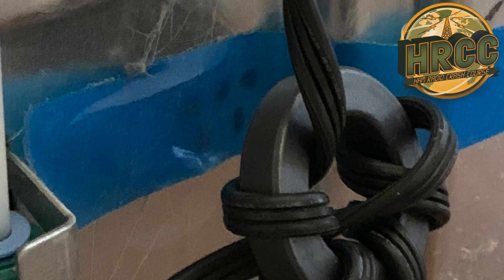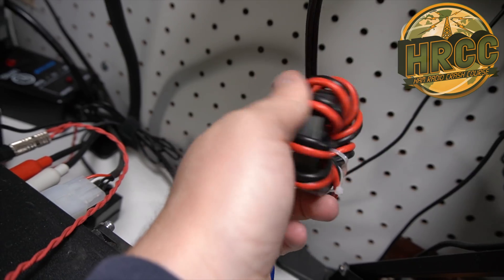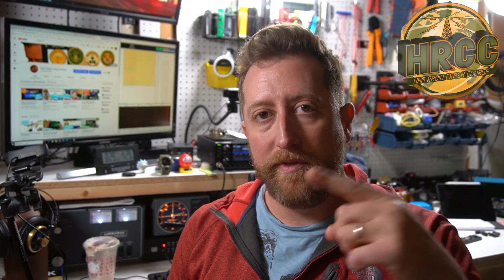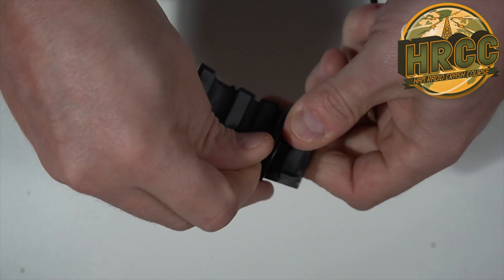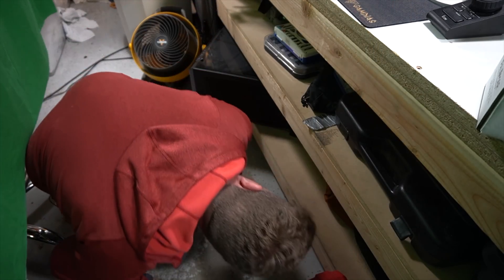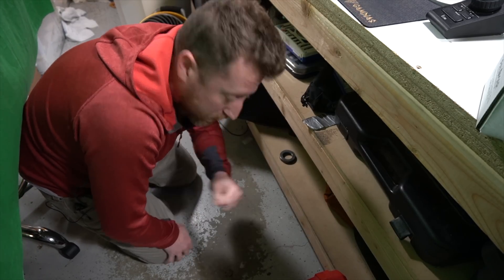The only way I was able to take that noise down to an appreciable level is wrapping the power cord through a toroid core about five times — at least five times. I also added toroid cores to my power and coax on my radio, my IC-7300. Every cable that goes into the back of that radio has a snap-on ferrite bead with multiple wraps of the cord around the ferrite bead before I snapped it closed. This helped a ton and brought my noise down significantly, which is the reason I receive so well even though I live in a really noisy suburb.